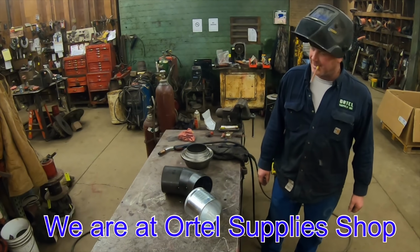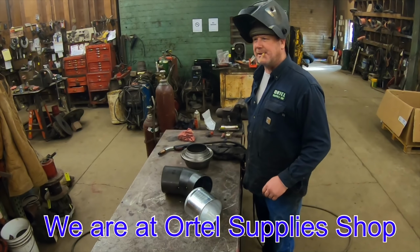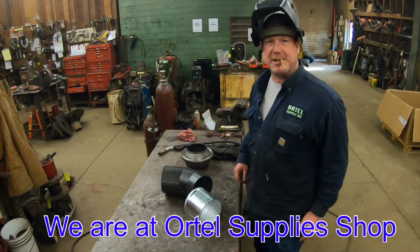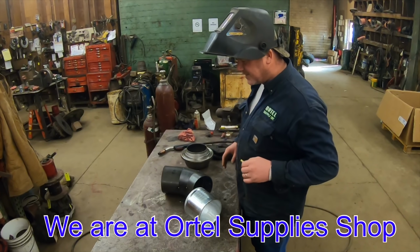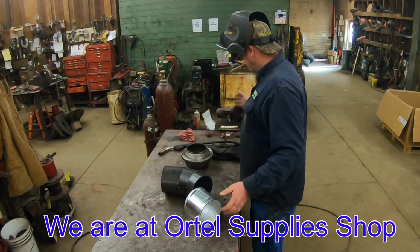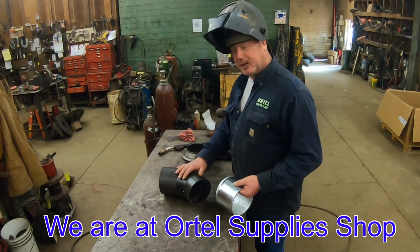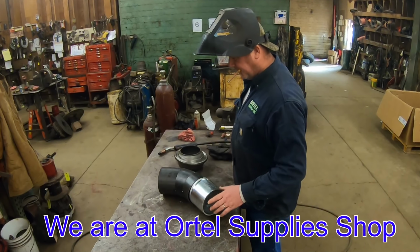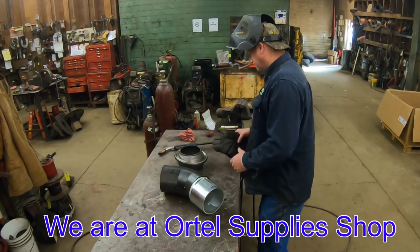All right, camera's rolling. Hello, today it's Friday, the 3rd of April, and by the way, give a shout out to Horgan Family Farms. Hi, Andy. Putting together an elbow for a hose connection for a manure injector system. What I'm gonna do is take our Miller-Matic 250, and I got a pre-tacked elbow here. Gonna put a hose barb and a fitting end to connect to the manure spreader, and then they'll be able to hook up their hose and inject manure into the ground.